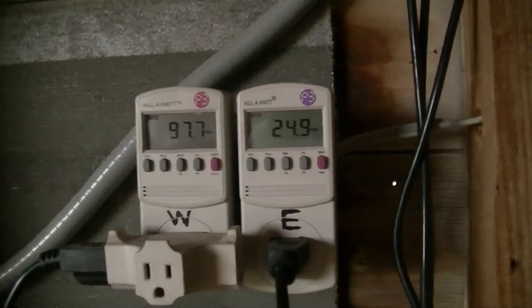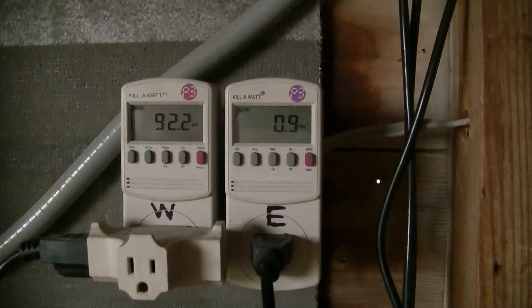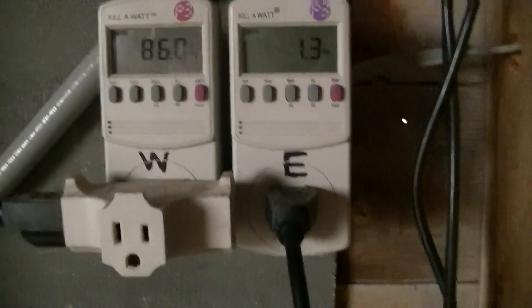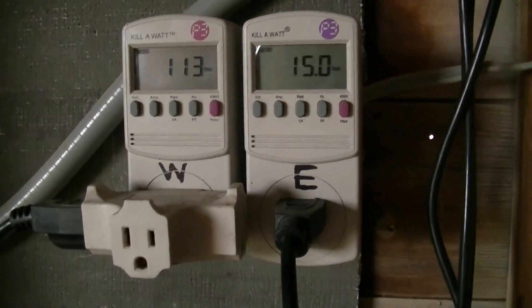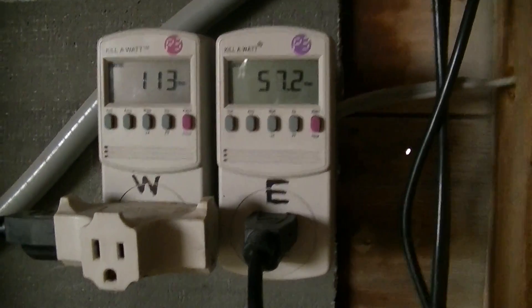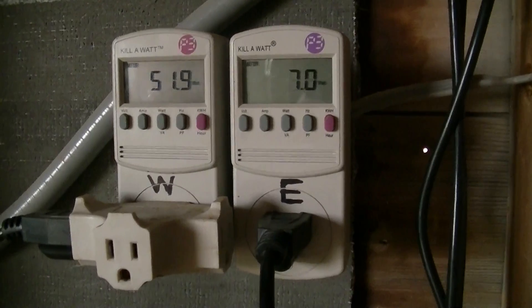I've had a couple of gusts get me into overvolt. They certainly work — I was here at the time — putting out some heat. We had about 100 watts of output on the one with really nothing on the other. The idea here is that under high wind conditions, this arrangement would split the power up a little bit and maybe take some of the stress off a single GTI — maybe even allow for some more output before overvolting and dump loading, with two separate dump load coils in the mix.